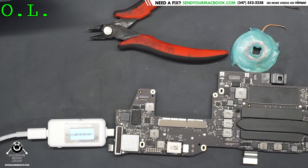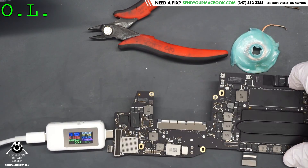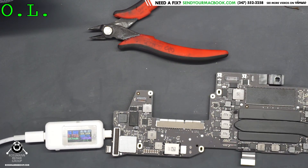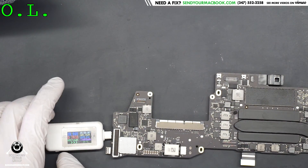And let's plug the charger in properly. There you go: 570, 538, 536, 568 - that's a happy MacBook. All it really needed was for me to remove that one capacitor on PP bus G3 hot, the main power rail that was bad. I could see it with my eyes - I didn't even really need a microscope for it. And just to demonstrate, I didn't use hot air. You don't always need hot air to replace a component.